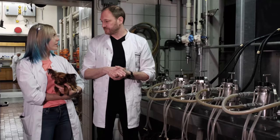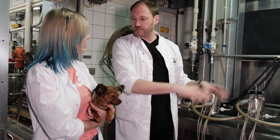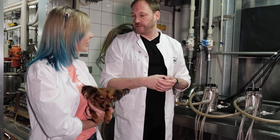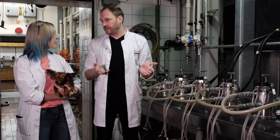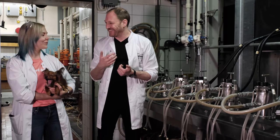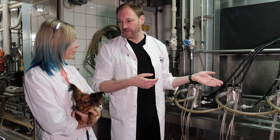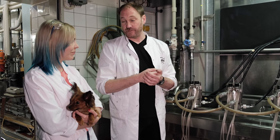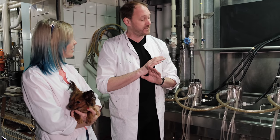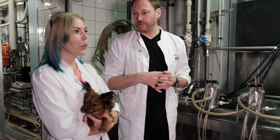Question, how do you clean all of this? So when you're done with the emulsion, you can push a button and then it's just streamed with water and it's cleaning automatically. So of course, if you have an accident, then it's a big, I'm not allowed to say, screw-up. It's a big problem. You must never have a failure in the temperature control, so the emulsion doesn't stiffen. If it stiffens in the cascade, it's a nightmare. The whole cascade has to be taken apart. Did it happen? Oh, it happens all the time.